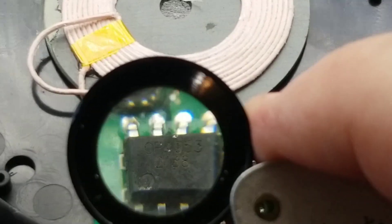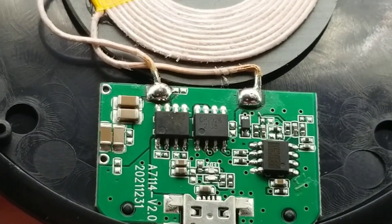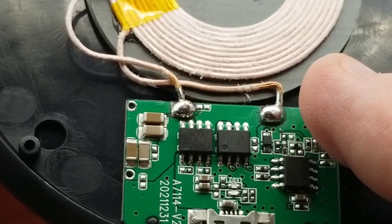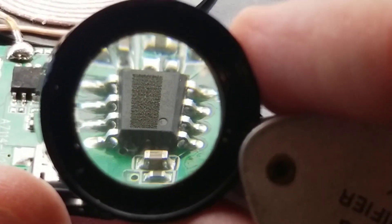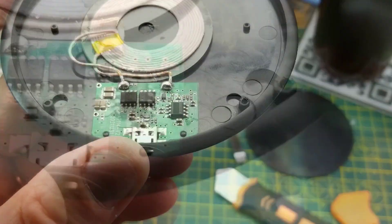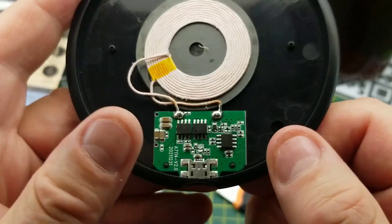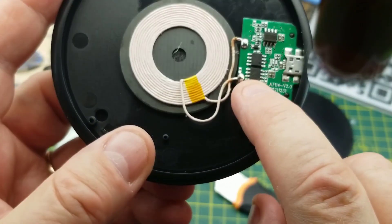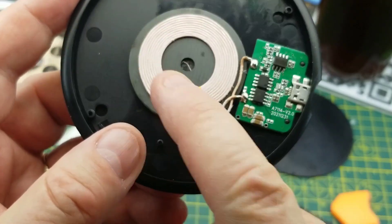This chip calls itself CP9926. The one beside it is CP4953. Based on where those two are, I'm guessing they're some sort of MOSFET package driving the coil. The third chip over here is clearly anonymous — they've seriously etched the number off it. I'm going to guess that one is negotiating the power delivery over the USB. I'm pretty sure the other two are some kind of transistor MOSFET or power package driving the current.